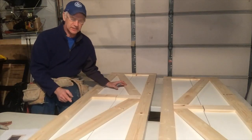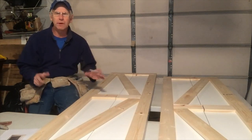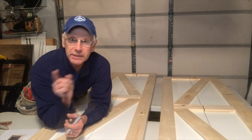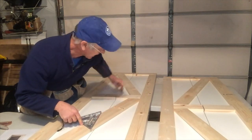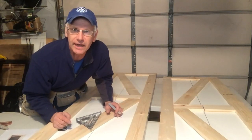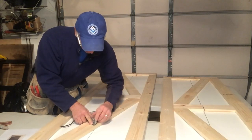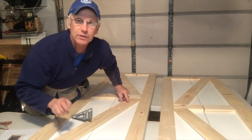We've got all four of our pieces cut — the miters actually look good. Remember, this is a barn door, so if your miters are not perfect, don't worry about it; that's kind of part of the design. Now, since it's just you and me, I'll let you in on a little secret: I forgot to cut this board on the bi-fold seam the first time. I tacked it and then realized — these are bi-fold doors, they have to bend! So make sure you take a straight edge, line up on the seam of your bi-fold door, strike that line, cut it, and put those two pieces in independently. Don't make that mistake.